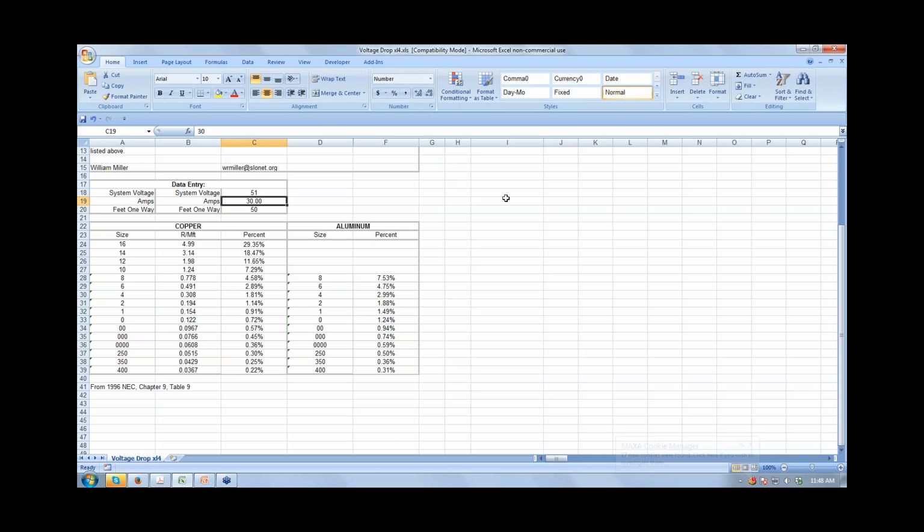My math chip just headed out the window on me. So that would be about 12 to 14, maybe 15 amps. But you're looking at how many feet? Let's just say 1,000. Yeah, probably not a lot coming out the other end there. And what size wire? At 1,000, we're probably going to be using 10 gauge. Yeah, you have a 73% voltage drop.